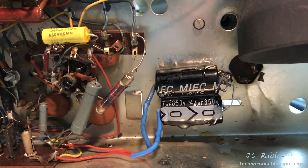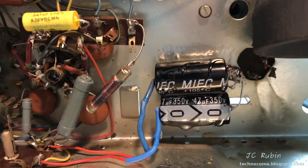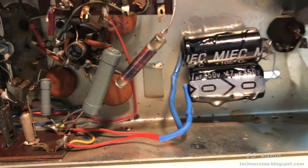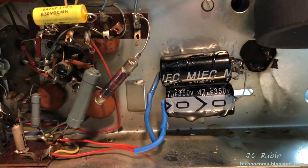I've permanently installed those capacitors, epoxied them into each other, made it a bit more rigid, and made the wire shorter. Cleaned it up so there wouldn't be any arcing or anything like that, and it's ready to go.